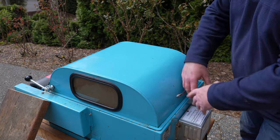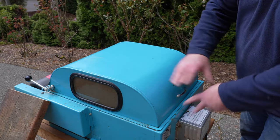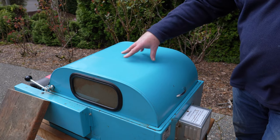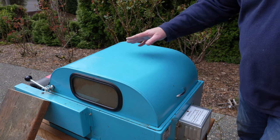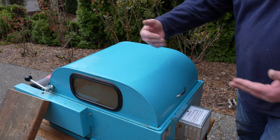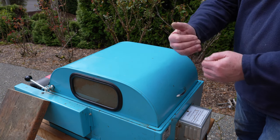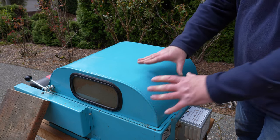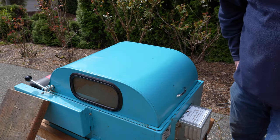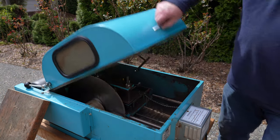At this point, there's all this mineral oil mist. And when I do this in the garage, the mist goes everywhere. So usually I wait about 10 minutes for it to settle, and I still get mist. And part of it is that the mist is heated up by the rock to blade transition, where it generates heat from the cutting process. And so all that hot air carries that mist right up into your face. So you want to not get too close when you open it up.